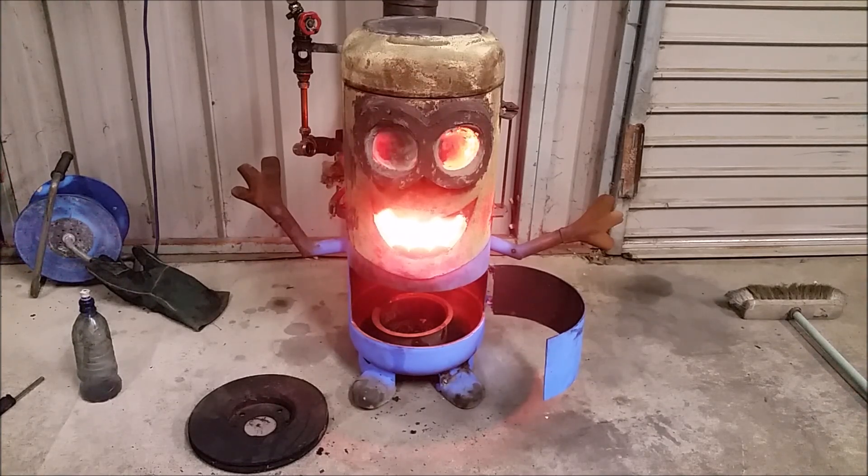I haven't set up the baffled situation inside and I can't really get to it - it's too hot. I need to do a few things with it tomorrow. I might increase the surface area of the burner unit so it's got more surface area to burn more cleanly. In the burn chamber it sounds almost like a rocket stove - in some ways it's very like one.